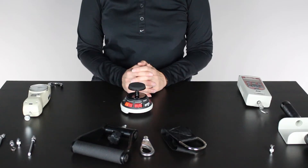Force gauges, as you know, are some of the most important tools that we use as ergonomists. So it's important to know when to use which. It's also important to note that all of the force gauges I'm talking about today have both a push and a pull function, as well as a peak force and sustained force function. Those are some things that you typically look for in any force gauge that you buy.